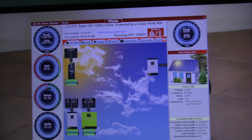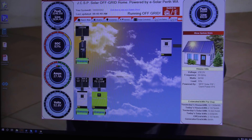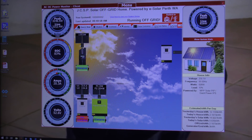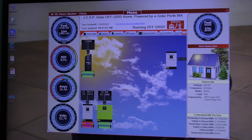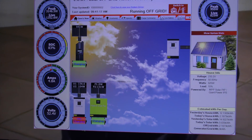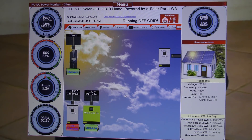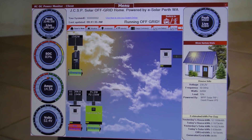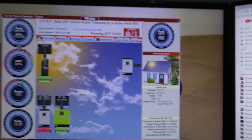So what changes have we made outside? We tested the Sun Flux 2 and gave it a really good test — it works great. It let us down just a little bit during winter, and the reason being it's not the unit that let us down; we actually broke some record-breaking rain, cloud, and storm records this winter — they say it's a 12-year event. It's just been so cold and we've had to boost the hot water off the batteries. That didn't really work too well, because if you're not getting enough solar to make hot water, you're also not getting enough solar to charge your batteries and afford to boost off them.